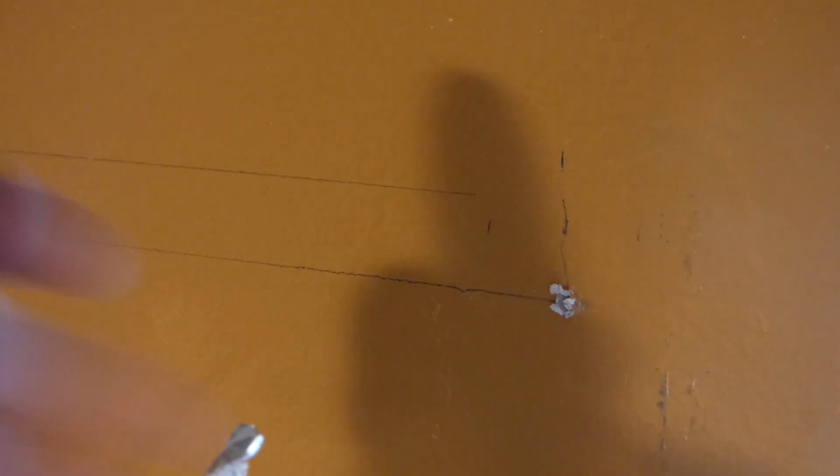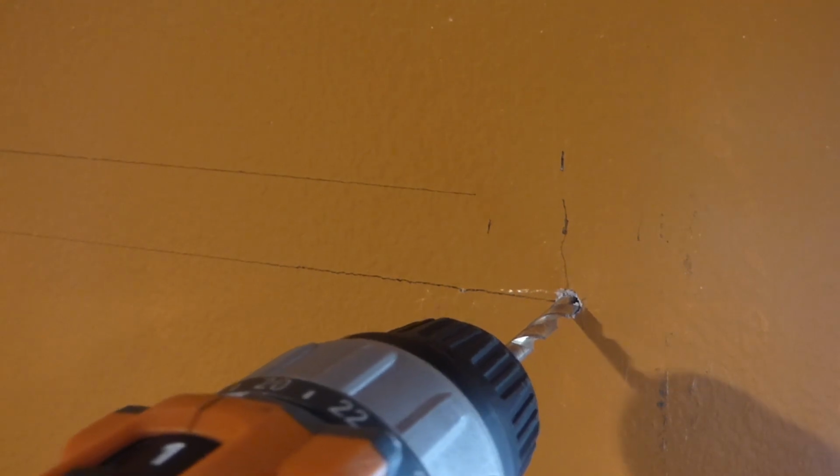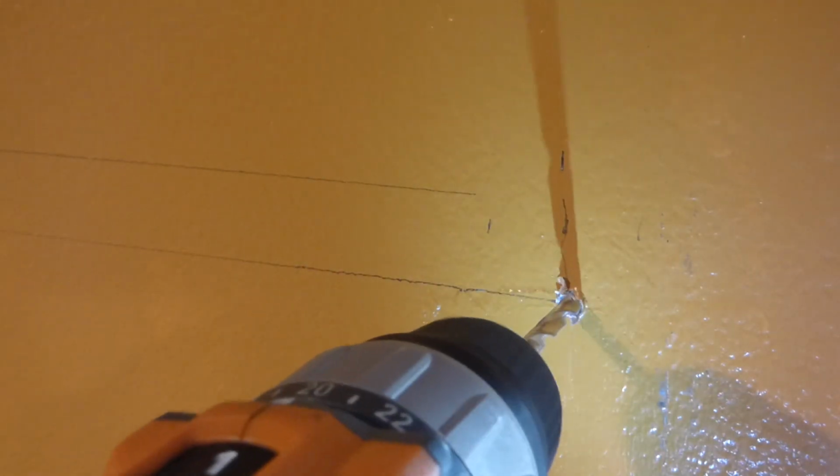I usually like to drill this and back up and make sure it's wood and not metal flakes on there. It's not drilled into a screw head or metal plate. Sometimes if you have other electrical work or plumbing work on the wall, you have metal plates that go on the 2x4 to block people from drilling in.